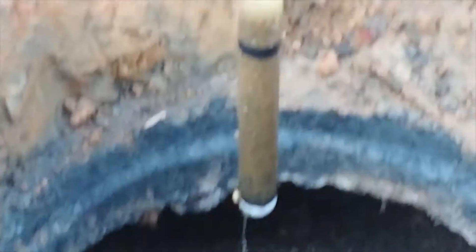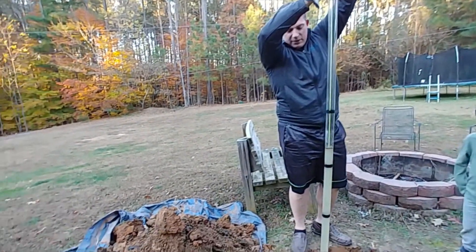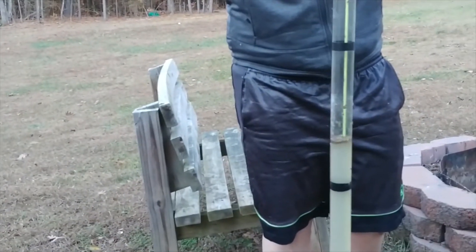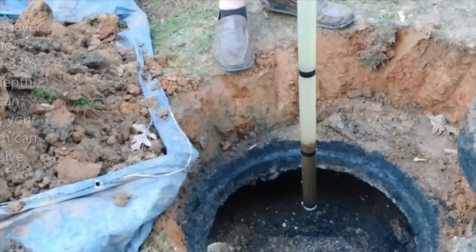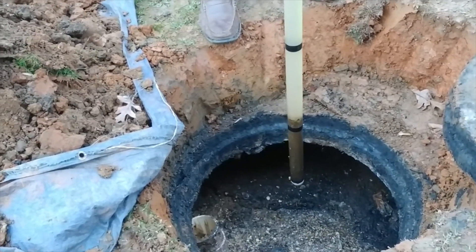Make sure you can see the bottom there. On this one I've made marks every 12 inches — I used a sharpie first and then electrical tape to make my measurement marks. You can see I'm a little above 12 inches — it's about 14 inches of sludge total, and there's about 54 inches of water. So that's 14 out of 54 inches, and the rule of thumb is something like 25 to 30 percent of the total water height can be sludge, so I'm getting close to where we're going to have to have this pumped soon. That's it — thanks for watching.